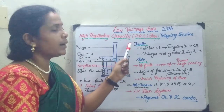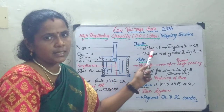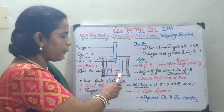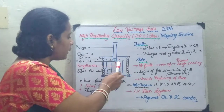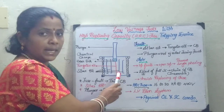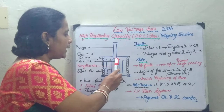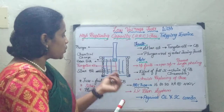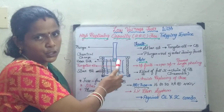Whenever we consider the condition of a fault, first the silver element melts. The heat of vaporization is going to be absorbed by the tungsten element, which is going to get melted. Since this tungsten element is going to be in series with a weak link and a chemical charge, it is going to melt the weak link and the chemical charge.